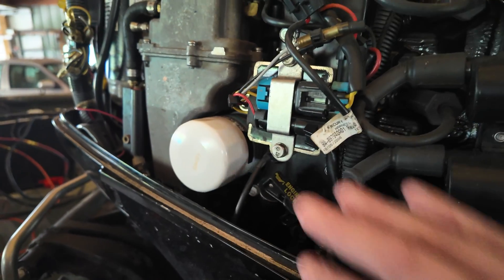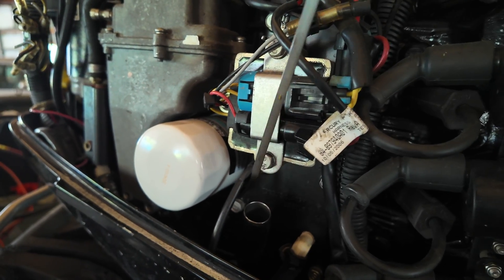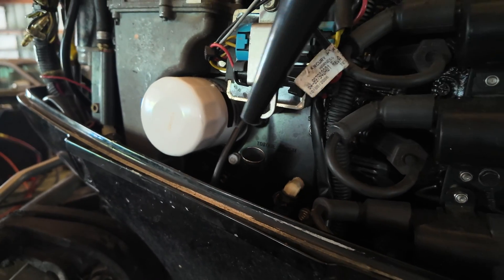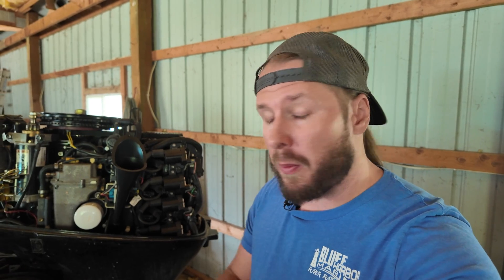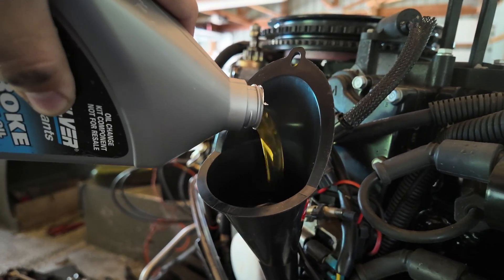But don't worry — we're checking for leaks. The next step is to find and locate your engine oil dipstick, which on this particular model is literally right next to where we are changing the oil filter. You can then go ahead and remove the dipstick and just place your funnel right into that bad boy right there. Now we fill it with the engine oil that comes in your oil change kit. This 60 horse is supposed to take three liters, which just so happens to be what comes in the kit. So I'm going to go ahead and just dump this oil in there, and I'm going to do this with all three bottles.